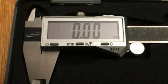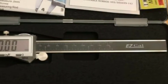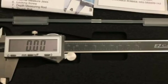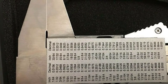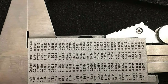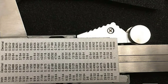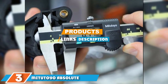Beyond the polished finish and solid design, the caliper's quality construction extends to areas others tend to forget about. For example, the battery compartment keeps the battery firmly in place and resists the lid popping off if accidentally knocked. The display is easy to read and accuracy is above average for calipers at this price. However, the fractional display is difficult to read at times, restricted to less common fractions, which may limit usefulness for measuring automotive diameters. This device also lacks an auto-on function.